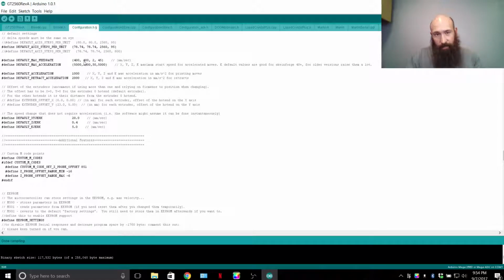But because of the limitations of your extruder and how fast you can melt the plastic and shove it out through a hole that's 1/20th the size of the diameter of your filament in a precise manner, the speed is not there necessarily. So you never essentially reach these maximum default max acceleration speeds.